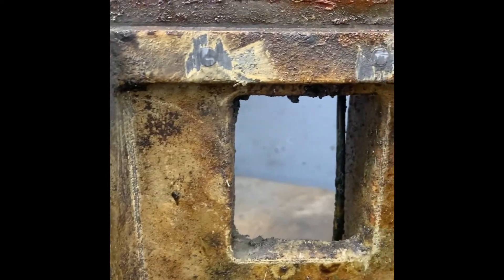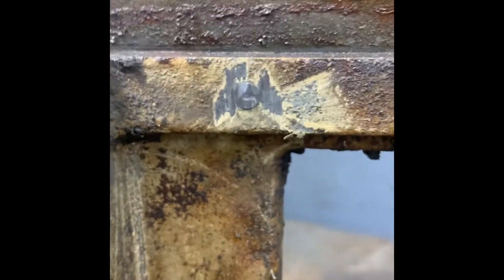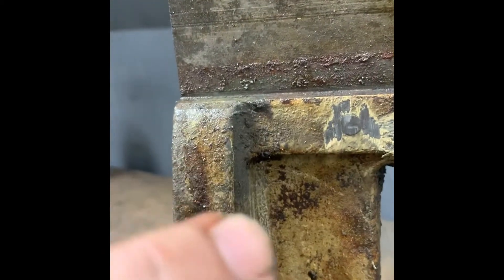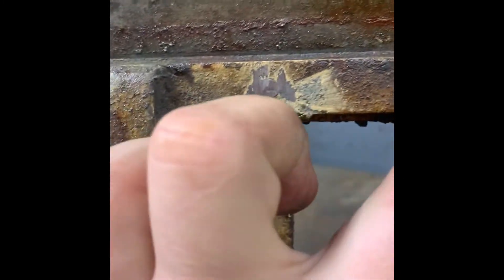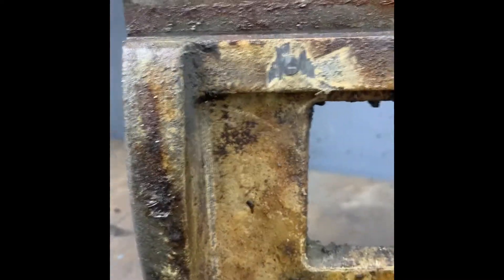I was not getting oil to all the ports. The two main ways were getting oil, but the cross slide ports were not — they were so plugged up with debris that not even compressed air would blow it out. When they drill those holes for oil, they come in from the side and from the bottom, and those holes intersect, then they plug them with little plugs. What I had to do was drill the center of the plug out, then blow air through with my finger over the other hole. I ground a little pick, got it in there, and finally after a few minutes of air, it blew both of them out. Then I taper reamed the holes and put taper pins back in them, cut them off with an abrasive cutoff wheel.